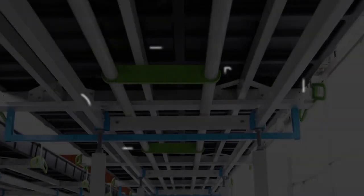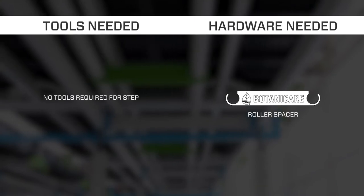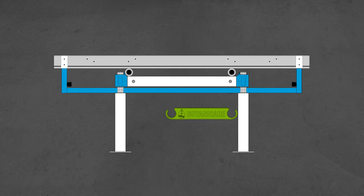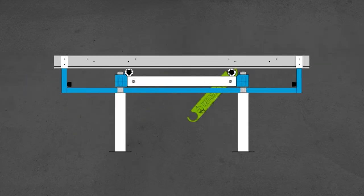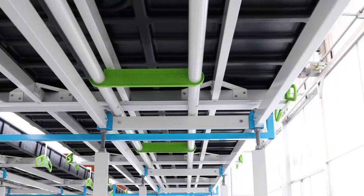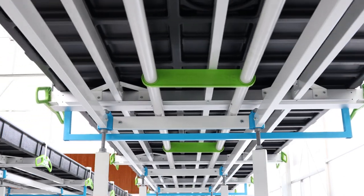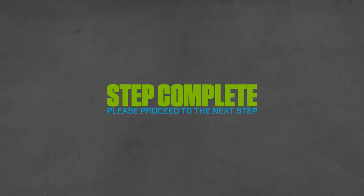Step 9: Installation of roller spacers. Roller spacers are quick and easy to install. Simply snap the roller spacer onto the roller bar past the installed guide bracket. Move the other roller bar toward the roller spacer and snap into place. Once all roller spacers are installed, pull the bench to the stops. The movement should be smooth with no catching. If movement is not smooth, adjust spacers as necessary.